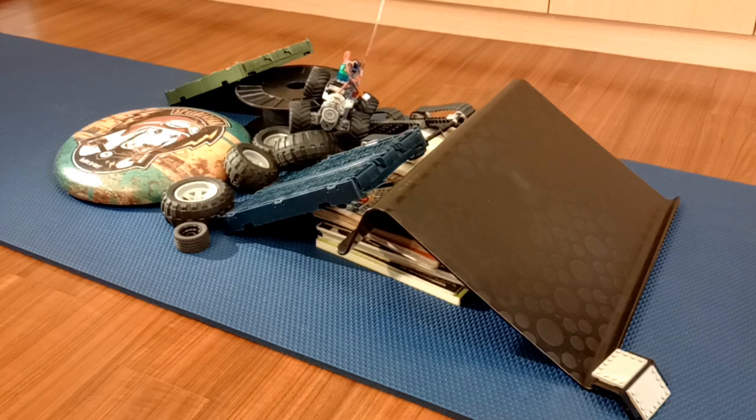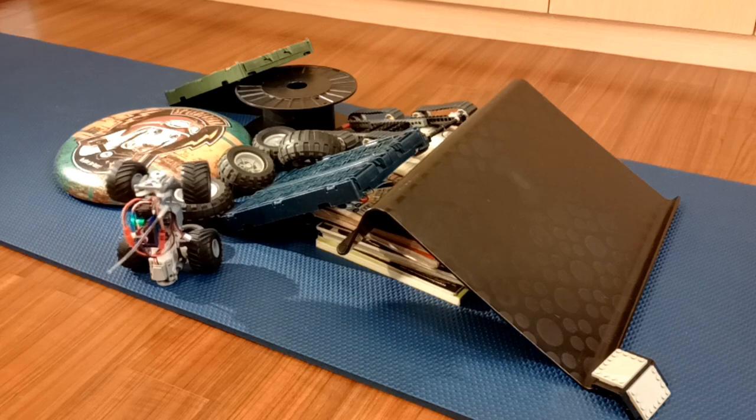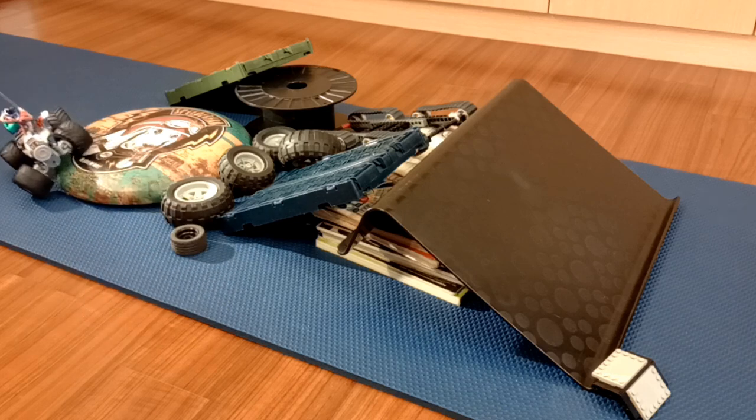I run a 2-cell LiPo battery pack with 350mAh of capacity, mounted near the rear axle and placed relatively low for center of gravity. This also helps balance out the motor up front, so it wouldn't tumble too easily going down hills.